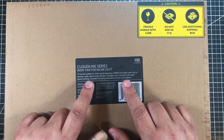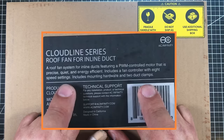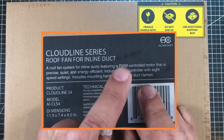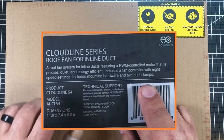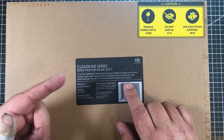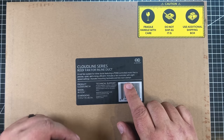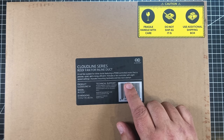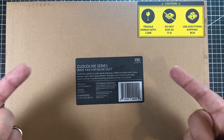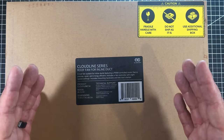This is a DC-based unit, not AC. You see a lot of AC units out there and they make a ton of noise. I want it quiet, and this also has pulse width modulation. So when I'm doing resin-based printing I can turn it down, and when I'm doing lasers I can turn it up — and it should be pretty quiet. You see a lot of these used for growing plants to vent fumes outside. You can use this for a lot of different applications; in this case, it's going to vent the fumes from my shop.